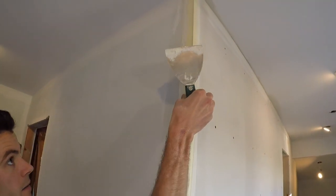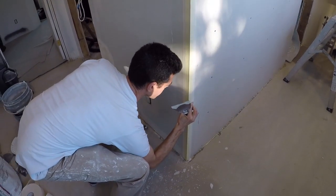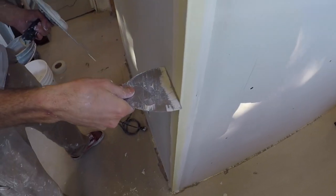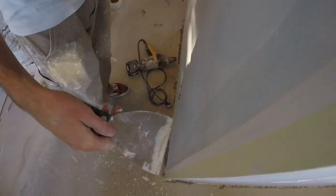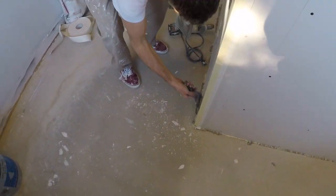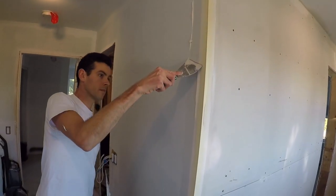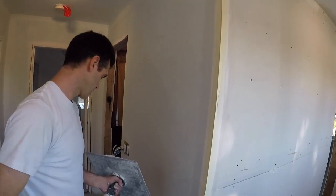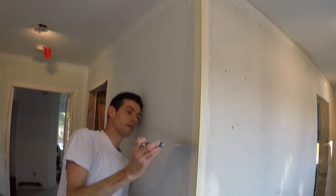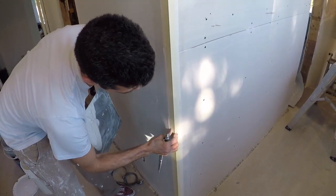Now's the time where you check it. I've got a bit too much mud under some of this part, so I'm going to make sure to squeeze it out. What we want to make sure is that we've got daylight — you can see there's a little bit of room to fill. I'll use my six-inch knife to check. That looks great. A little bit full here still, or I need to pull the bead a bit.